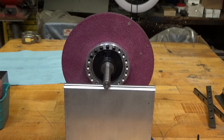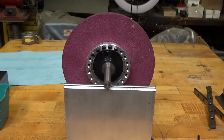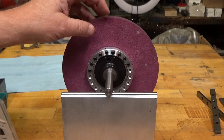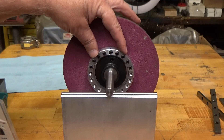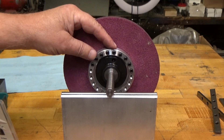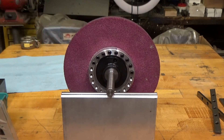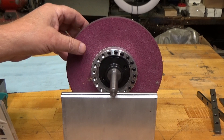I've got some longer set screws that are a little heavier. I'm going to go get them and come back. Okay, I'm pretty close now — I ended up using longer screws in the center that are a little bit heavier. I recommend that if you purchase these, you get yourself some extra quarter-inch 20 set screws.